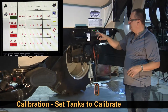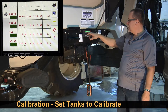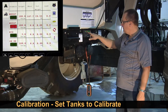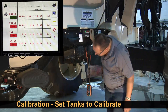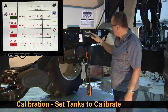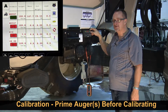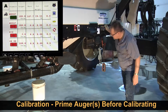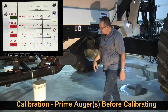We have the ability to calibrate all four tanks at once if we want. When they're active and ready, the red light flashes. The green light indicates the ones we're going to calibrate. We only have product in tank 1, so we're just calibrating tank 1 for now. We'll hit our master — but we don't want to prime our auger empty. We don't want to measure empty revolutions, so we've got to get a little bit of product in the auger first. So we engage this to make sure we have some wheat or product in that metering auger.